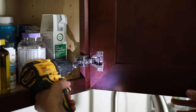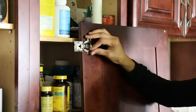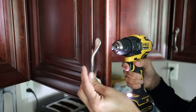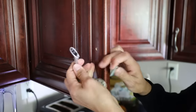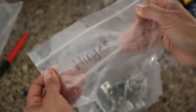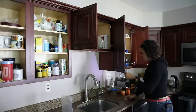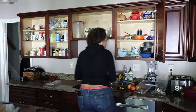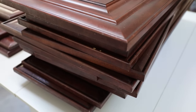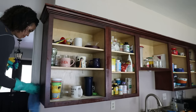Whenever you're painting kitchen cabinets or vanity cabinets, it's so tempting to just leave them up and paint them in place. I get it — I've made that lazy mistake before, but this time I wasn't going to take any shortcuts. In my experience, the prep that you put into it is what you're going to get out of it. I took all the hardware down and put them in baggies so I didn't lose any hinges or screws. You'll need to figure out where you're going to put your cabinet doors while you're doing all your cleaning and priming of the boxes.